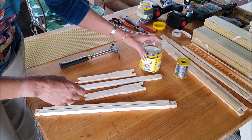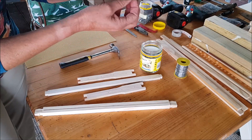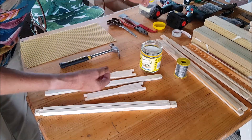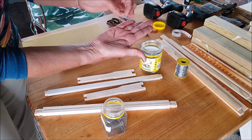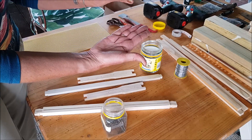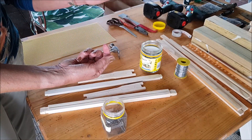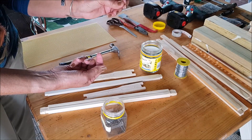You'll need some nails — some small panel pins with a flat head to secure the wire, and also panel pins like these ones. These are about two and a half centimetres long and you'll notice that the panel pins are very narrow. Although you're using soft pine, you need to make sure that the nails you use are quite thin, otherwise you run the risk of splitting the wood when you're nailing it together.